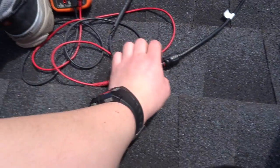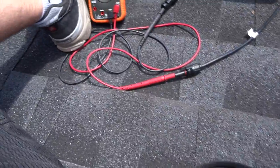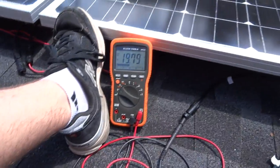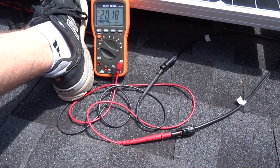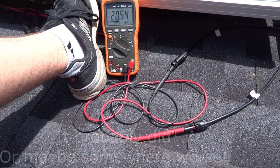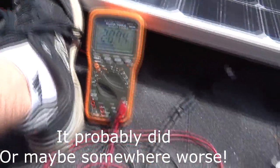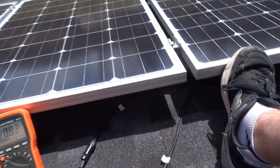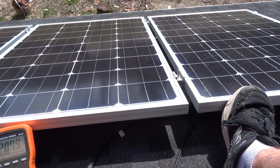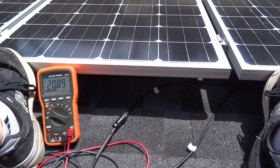These connections on them are kind of interesting — haven't seen those before. They have that really tiny seal, which makes me wonder if they're water resistant. It just went down to 18 for a second and went back up to 19. I wish I could show you the logo on the back, which almost seems like it's shipped from China. The voltage is back up a volt, which makes sense — solar panels without regulators are bound to fluctuate because of the sun.